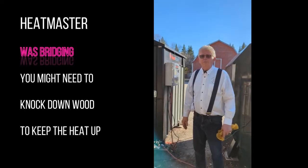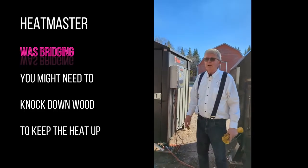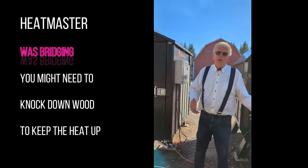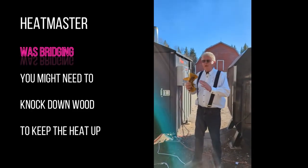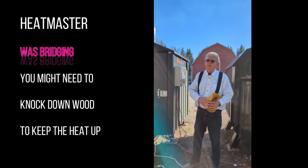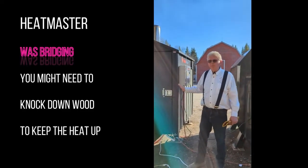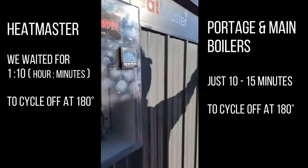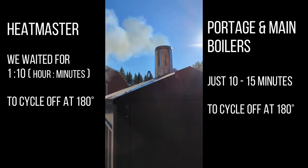Same scenario on your farm or acreage: you've filled the boiler after supper, it's a cold winter night, heating comes on into your shop or barn, taxes the water and takes more heat out of the boiler. It gets the center burnt out of it, and if it doesn't fall down because it's burning up against the cold water - cold for combustion - it doesn't break down. You get the bridging action we've been experiencing in all three of the pre-burns. Nobody's going to get up in the night to knock down the wood. It did get to 180 degrees while we were talking - a one-hour ten-minute cycle to get up to temperature.